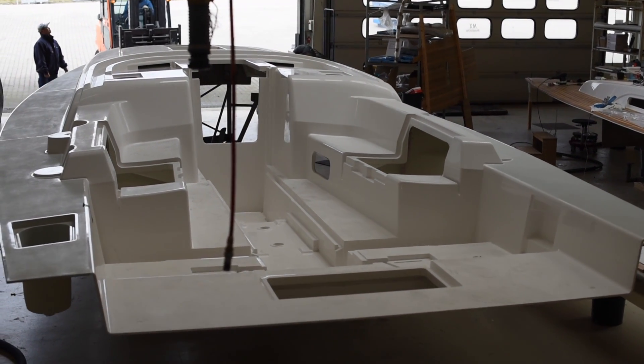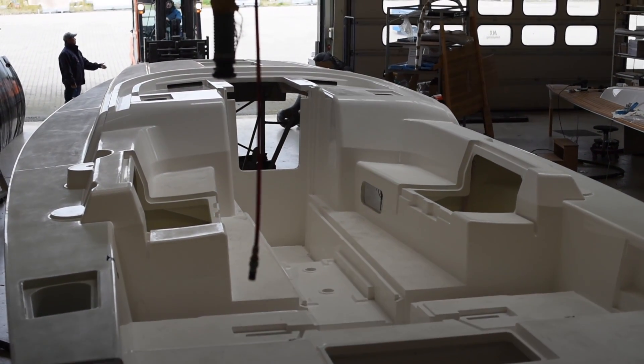Another advantage with epoxy is that it is not so sensitive to sun impact. When you have a white hull in the sun in the Mediterranean area, the surface temperature goes up to 55 degrees. If it is a dark hull, the surface temperature of the gelcoat goes up to 85 degrees. When we deliver a polyester boat, we don't normally need to oven bake it. So when we laminate here at 22 degrees in our lamination factory, then when half a year later the boat comes to the Med and bakes in the sun, there is a risk of the laminate shrinking even more, curing in the sun, especially with dark boats. What happens then is that the gelcoat surface becomes uneven because the fiberglass underneath the gelcoat shrinks.